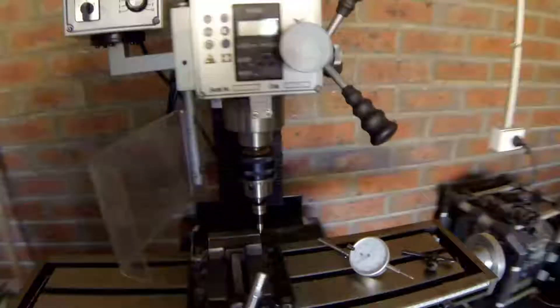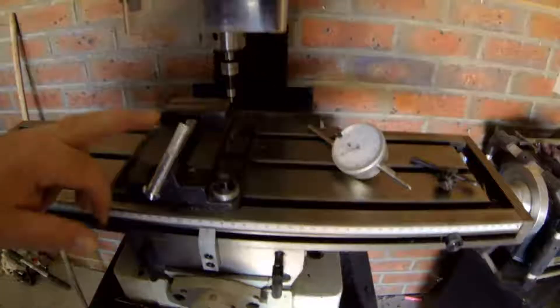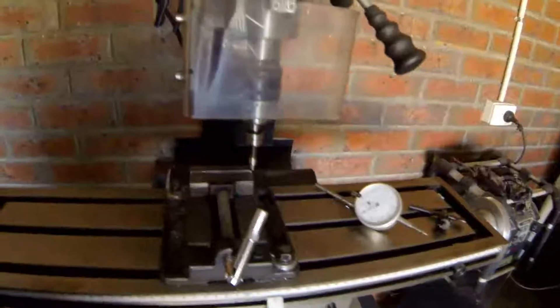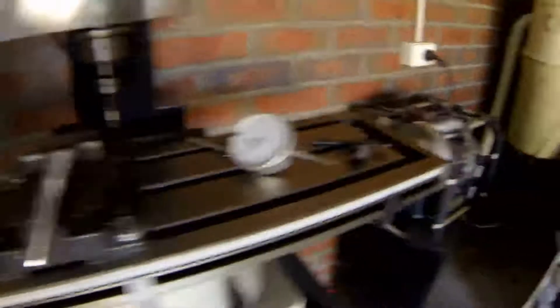But prior to that, time to de-winterize some machinery. I usually cover my mill with grease and oil, so I've just cleaned all that up, lubed everything up. I checked the tram on the vice itself to make sure it's all good. Now everything's nice and smooth as you can see, so we're ready to make parts again.